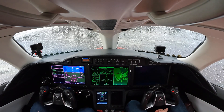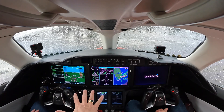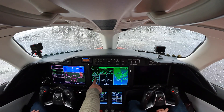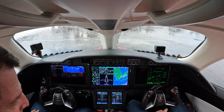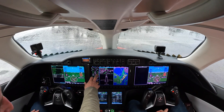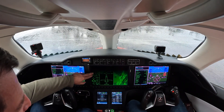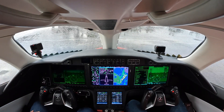Now the generator is going to take over from the battery, and you'll start seeing the co-pilot PFD come on, co-pilot MFD coming out. You'll hear the environmental system kick in to start cooling the cockpit down. Right now I'm watching these amps — I like to see the amps on the engine that started get below 200. I've got 32 seconds set. Start button, introduce FADEC. I've got a starter light, an ignition light and a start. I've got N1 rise within 15 seconds. I've got N2, oil pressure, temp, and fuel coming up. I've got a starter dropout before 32 seconds — I've got a good start on number two.